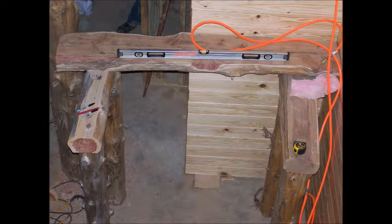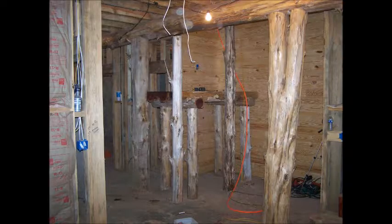The 3-piece top was put in and also leveled. The platform has to be leveled by code. They'll let you get away with maybe 1/8 of an inch overall, but it really needs to be as level as possible. These 3 pieces will be countersunk also from the top and permanently lagged in from the top and plugged later. And it will also be secured to the wall from the other side, and the post to the left to be secured just to keep this platform rigid.